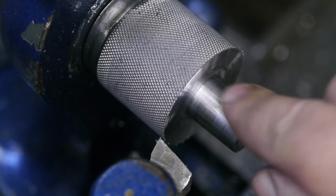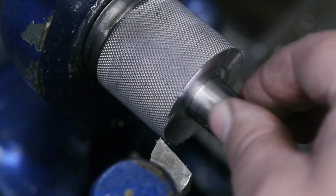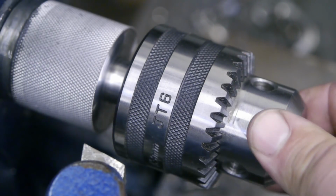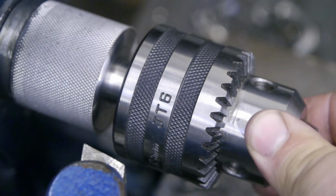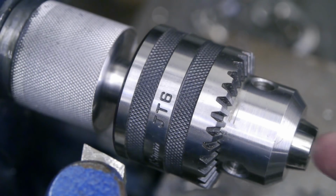Yeah, that's actually not too bad. Could be better, but I think I can work with this. I'm doing a test fitting, and it looks like the taper is way off. I had a look inside with a flashlight, and the rear is too big, the front too narrow. So now I'm going to set up a dial indicator against the top slide and carefully change the angle a bit, and take a few cuts and see if I can get it to fit a little better.